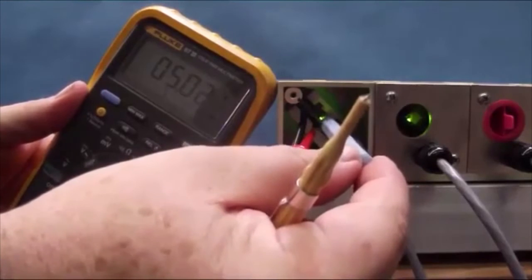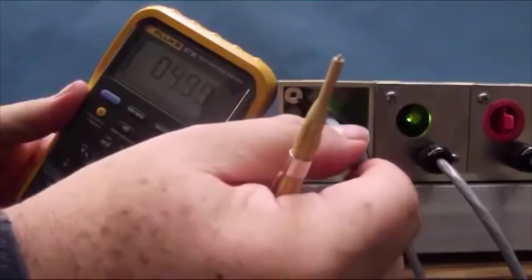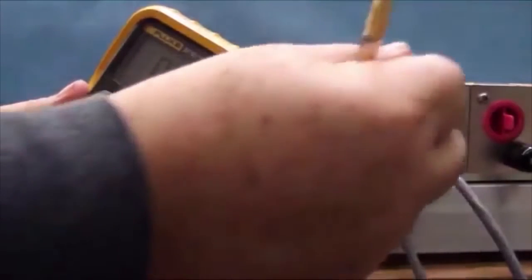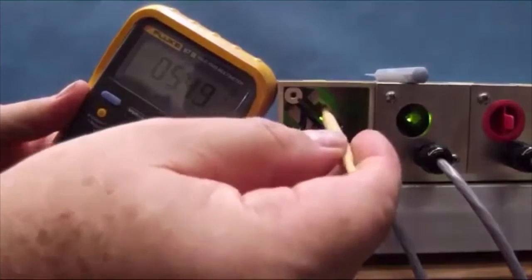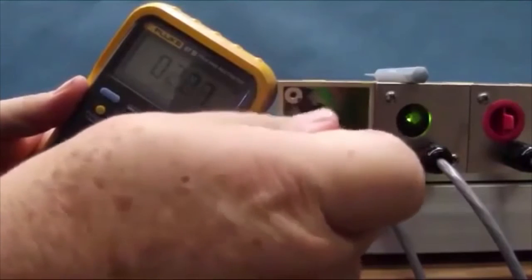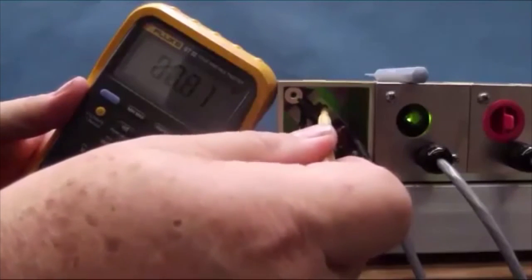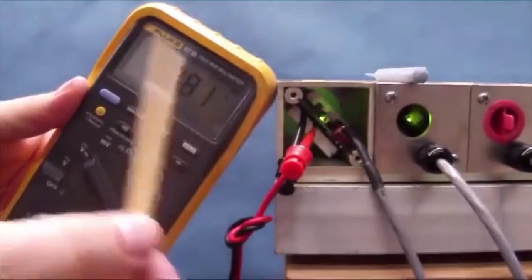So we're starting at 5.0 and we're turning the blue tweaker clockwise until we see a 5.5 volt display, and that now has adjusted the frequency correctly. So I'm going to remove my blue screwdriver and do our final adjustment, which is to restore the DC level, which is what the potentiometer is doing, to the 0.8 volts, which is our final target voltage. And this is a counterclockwise adjustment. And you see that I am at 0.8 volts DC, and 0.81 to 0.79 are acceptable.